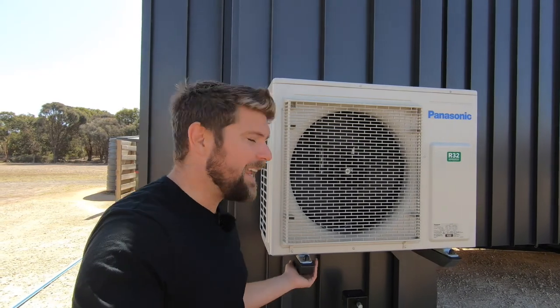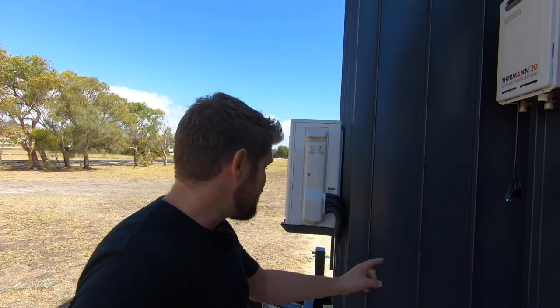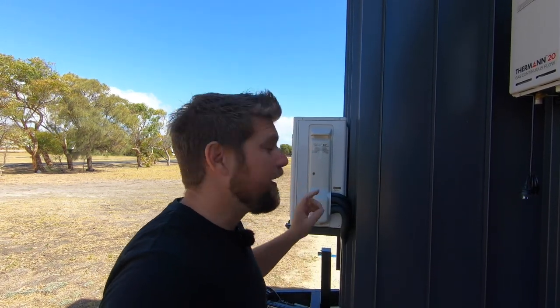Because this thing's going to travel down the road and it's sitting on a sort of cantilever bracket, I've also reinforced the top. I put a timber into the stud wall on the inside of the house, brought bolts through where I've attached a bracket and a rubber mount that supports the top of this unit - that stops all movement both laterally and back and forth away from the house. Now there is one serious issue with the location of this air conditioner, and that is it's a long way forward on this drawbar - right out near the end. I actually disconnected the trailers and weighed my tow ball weight and it was spot on. But by putting the air conditioner out here at about 45 kilos, it's put almost the entire 45 kilos of extra weight down on that tow hitch, which is a bit much. I've calculated that I need to put 117 kilos at the opposite end of the trailer to counterbalance that air conditioner, which is a problem if I want to tow this trailer with a standard four-wheel drive.